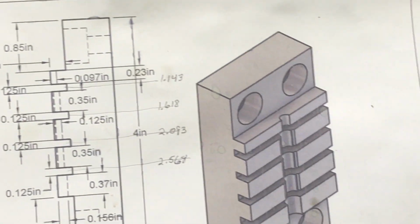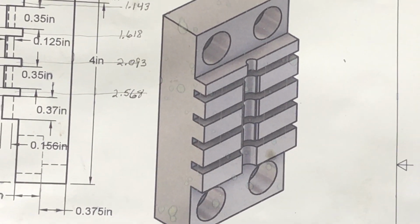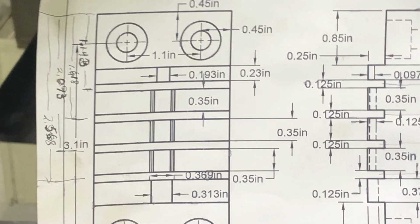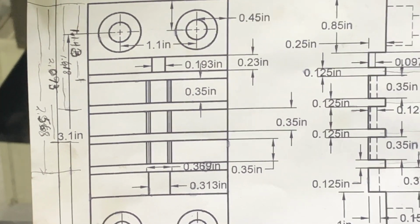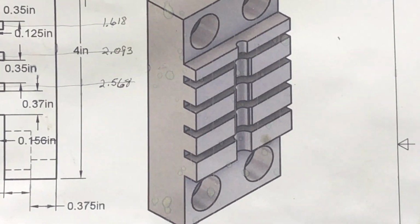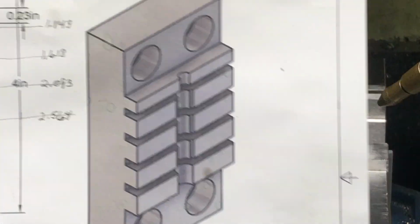And again, when these two pieces of swage block come together in this 50-ton press or iron worker, I'm trying to maximize the amount of surface area so that when they come together, that's kind of absorbed in a larger surface area, because I think the damage to the original swage dies is due to just the amount of force. I don't think 50 tons is required to do the swage, but that's what they're using to make this. And they can't limit how far they come together. There's just a full stroke. And so it's taking 50 tons every time it comes together.